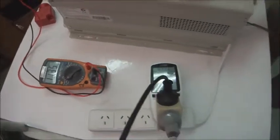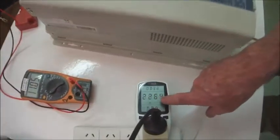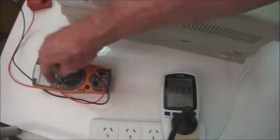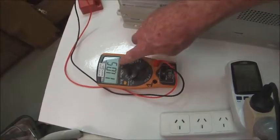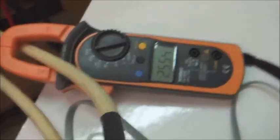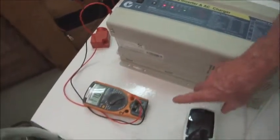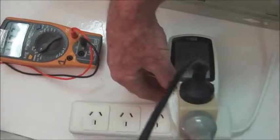Even though this is a 2,000 watt inverter, we're going to increase the power more. We've increased the power now to 2,261 watts. Battery voltage down to 11.05 volts. Input current 255.6 amps. Unit's still running perfectly. Output voltage — that's the power at 2,230 watts. No problem.